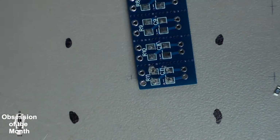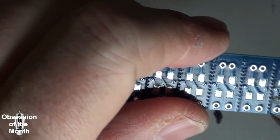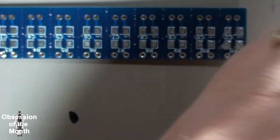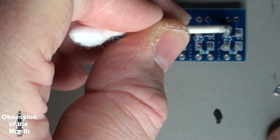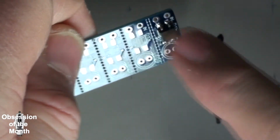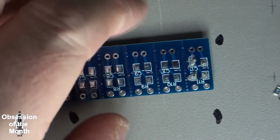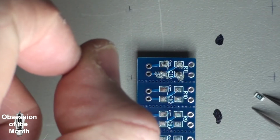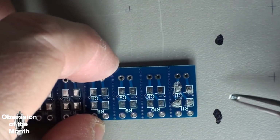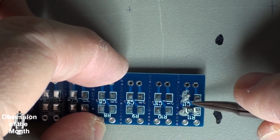The way this works is we have the 2 terminals that come in, and right here you can hook up AC or DC, either polarity, doesn't matter. And that goes through this little rectifier and comes out as DC, then goes under the board and goes through a resistor, and I probably should have put the resistor first, but I don't know if it matters too much.